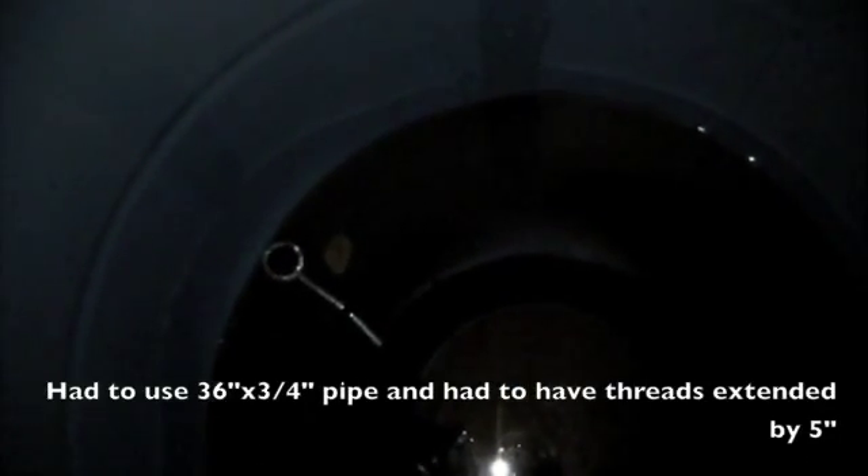What we have here is the waste oil collection. There we go — the stand pipe. Basically the settled oil, or the good oil, with less debris and less water, will go into there. That's about eight inches from the bottom, so that'll allow for quite a bit of sediment settling. And then on the other side there's a drain, so if I ever need to clean it, I can drain it.